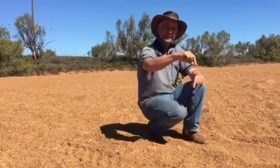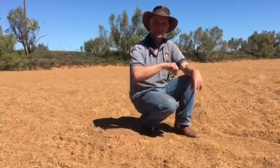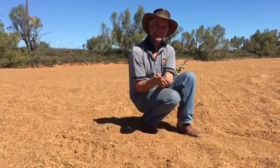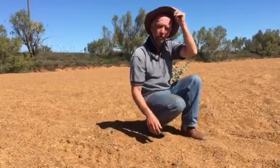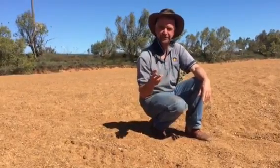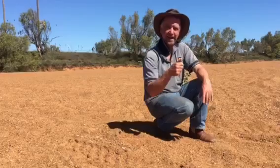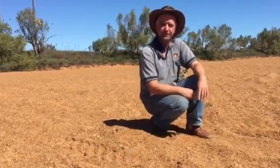Around the 25mm gap — called the annulus — we pour down the graded river sand. It acts as a fantastic primary filter to make sure that all the fine particles of silt are filtered out before the submersible pump, which pumps clear water to the surface of your garden.